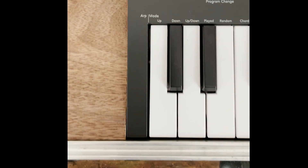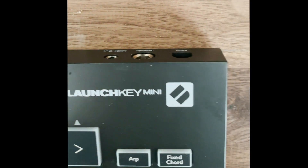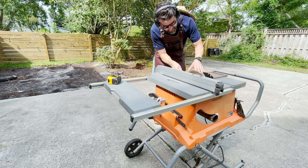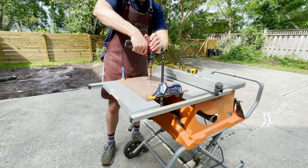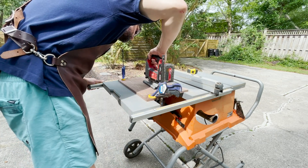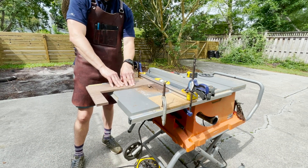The next step was to start planning the cut for the Novation Launch Key Mini, which was chosen because it seamlessly integrates with Ableton Live, one of the DAWs that's going to power this recorder. Once I had the cuts planned for the MIDI controller, I went to the table saw to start making the big cuts. To make the long cut in the back, I started with the drill and followed up with the jigsaw. Anytime I'm making finished cuts like this, I do the initial cut with the jigsaw and then come in with the router table to give it a good, clean, straight, flat edge.